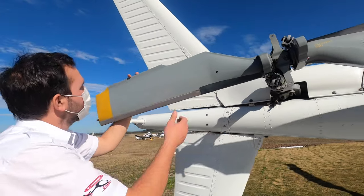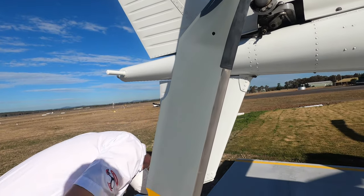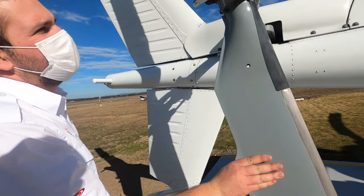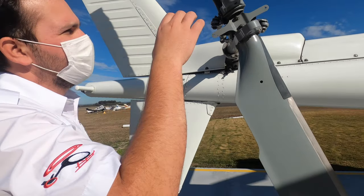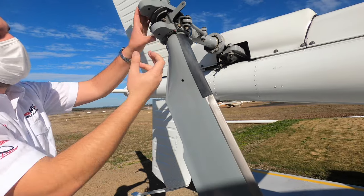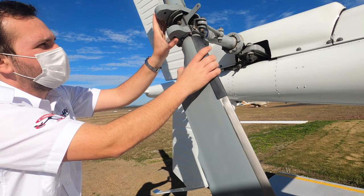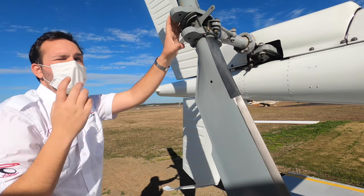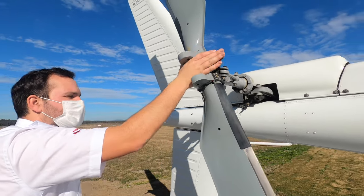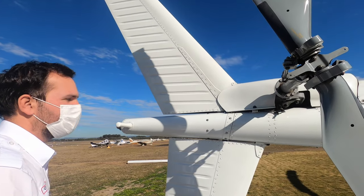Your spider here — got a little bit of grease coming out. It's fairly new, this spider, so that's why it's got a bit of grease coming out of it. We've got another chip plug here — this one's got a detection light in the cabin and a little warning light to go with it. So not too much grease coming out of that, feeling in good condition. If it's been tied down overnight, there is a block that goes in here — a tail rotor block — and a pin that goes through there, just to stop it teetering around at night in the wind. Make sure that is definitely removed before you go flying. A lot of people will physically put their hand in as they walk around, just as a physical reminder.